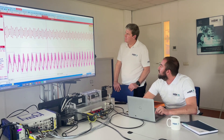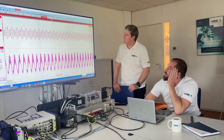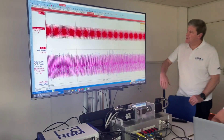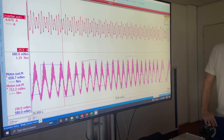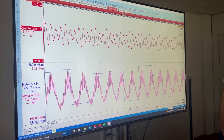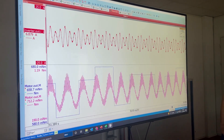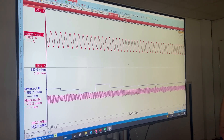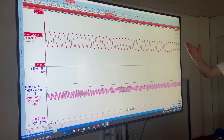And we can play it back — we can watch that as a playback of live. We can see that current is messed up because that's interacting with the back EMF and all the stuff going on. For this example we're making the torque intentionally awful — we're actually injecting currents to make it special types of awful. The average is smooth. Is that ever real — does an inverter really ever do that?